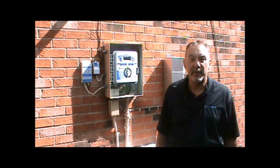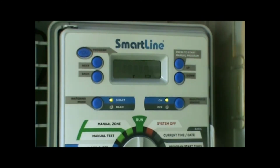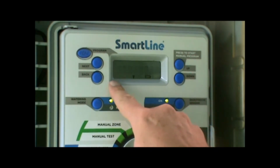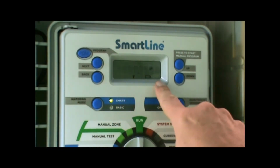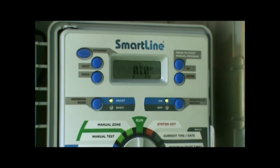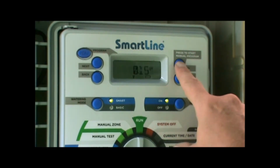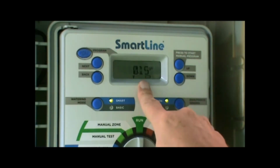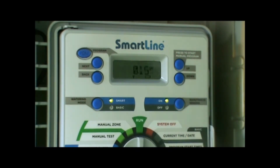Next up under review is minimum deficit. From the advanced menu, push the up button. This feature requires that a zone deficit be greater than the minimum deficit settings in order to run during a scheduled program. The setting is global for all zones in auto adjust. The range for the global setting is 0.00 to 0.50 inches. The factory default setting is 0.15 inches.